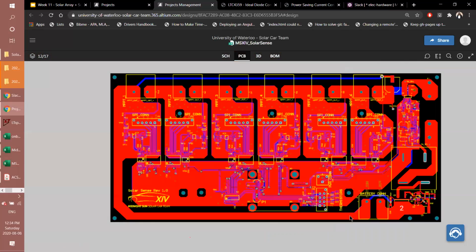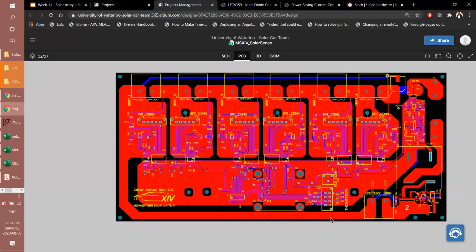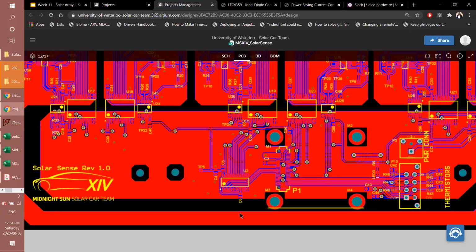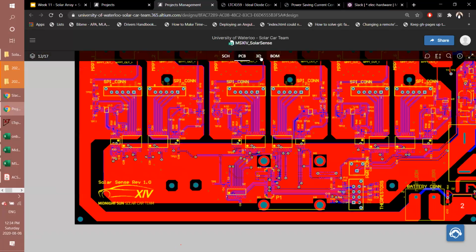It's not ideal, but it really shows you how the loop is closed and how you have all of your protection mechanism here on the left. Spacing-wise, it was fitting pretty well and it keeps the linearity. And then the entire return path has to go around. But for this thickness of trace, it should be pretty fine. But we are still going to be testing this board, so we'll see.